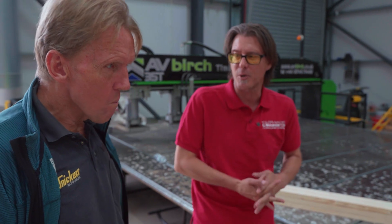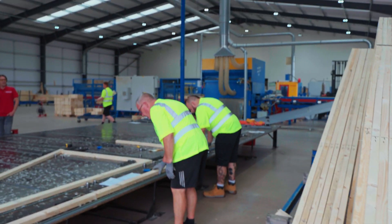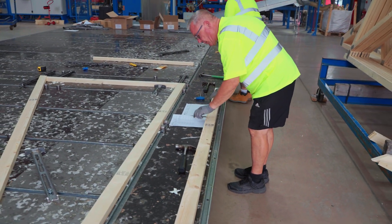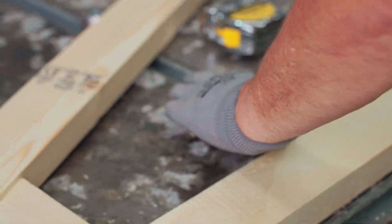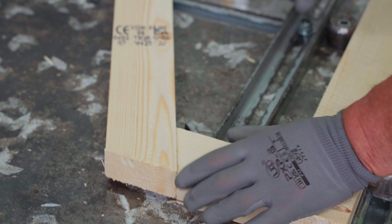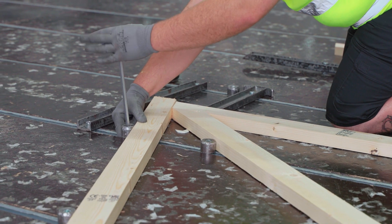An attic truss you might be towards 40 degrees or maybe even higher. He's got a drawing there and he's working to it — on this particular occasion he's putting it together the old-fashioned way using measurements and drawings rather than the lasers. Generally it's a good idea to use them, but on some jobs if you've only got the one truss, Lee might as well just get ahead and measure as he goes.